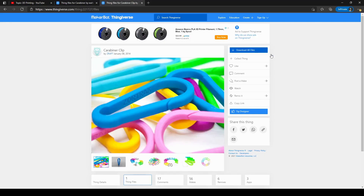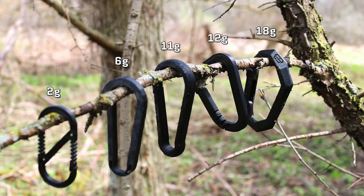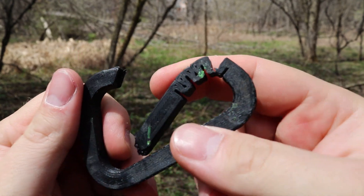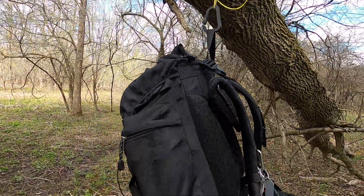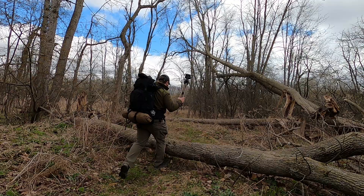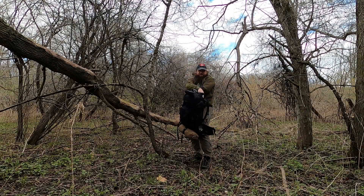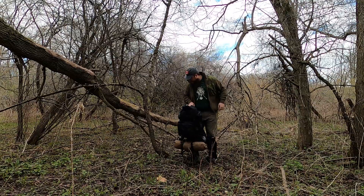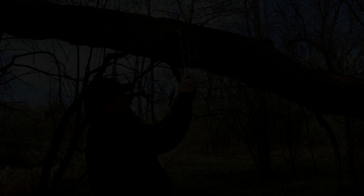I went and picked five different models from Thingiverse, ranging from a smaller S-beaner all the way up to this burly two-piece carabiner. Here's the five carabiners I printed and all their weights, all printed completely solid. It's important that not only do the carabiners not break from basic use, but also that they don't deform or bend open to release whatever it is they're holding, and they also need to be able to hold a reasonable amount of weight. So at this point, I took my carabiners out to the woods for some testing. The weight test is pretty straightforward — my skatepacking loadout is 35 pounds. I figure the carabiner should be able to hold at least this much weight, so the test is to hang my backpack using the carabiners from this tree.